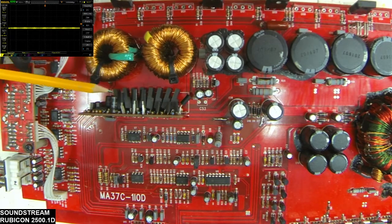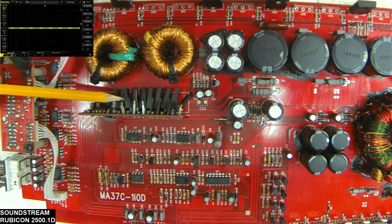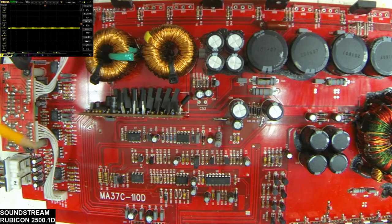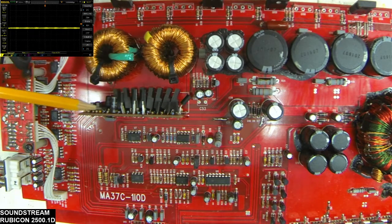As long as you have those voltages present and you've rebuilt this card properly, you can reinstall the card. You don't have to have your output transistors in, and you should be able to see your negative drive and your positive drive on the gate pads of the output transistors. You should see both those drives. If you see high side drive but you don't see low side drive, then you still have a problem with your drive card.